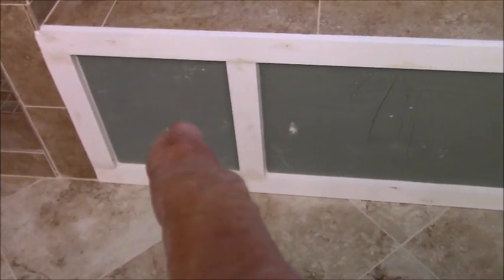This porcelain tile, very good tile. New Schluter up there. We did something different with the face of the tub. I normally tile the face of the tub, but the customer wanted panels to match the panels that they're having on their vanity. So I just did some 1x. And I was going to do wood, but all the plumbing is inside of there, and wood would be very difficult to cut through if there was ever a problem. And this is green board, so much easier.